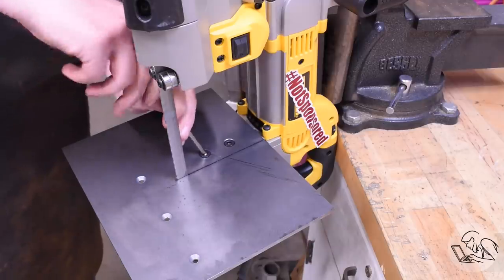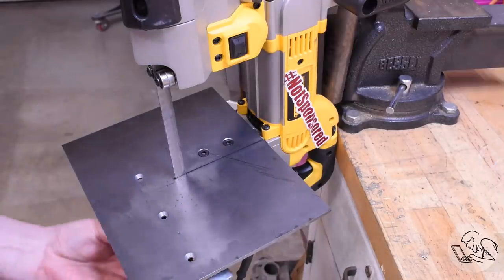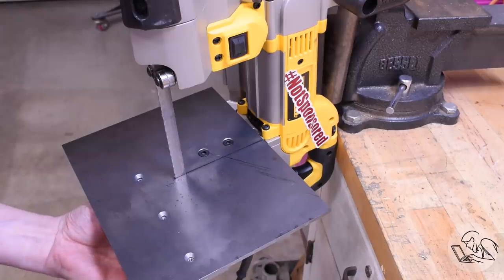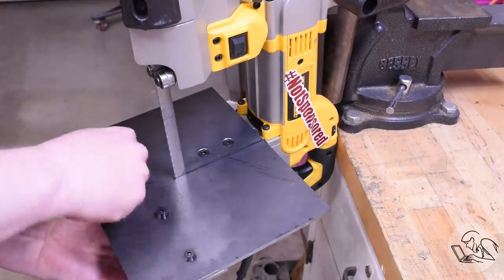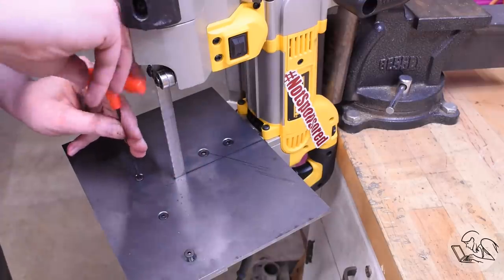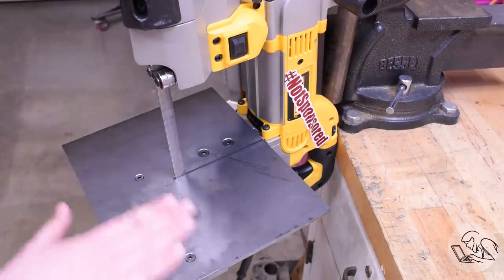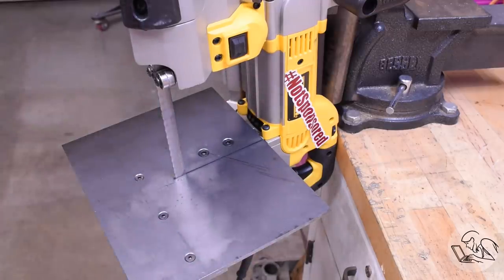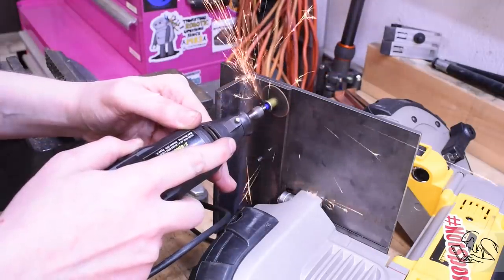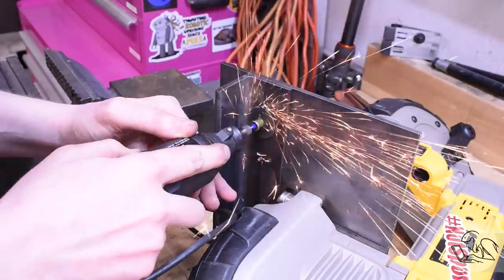I flipped the part 90 degrees, very carefully touched off on my machined edge, zeroed the DRO there, then moved out, touched off on the rough cut side, and just milled down to zero on the DRO in multiple passes — I end up with a nice clean edge that matches all the way down. Okay, let's do some final fit-up. I've got the table bolted onto the saw and now I can bolt the angle iron down underneath. The holes all line up because of the magic of the DRO. All the bolts are countersunk so nothing will interfere with sliding stock over the table. I had to shorten the bolts on the underside because they stuck down too far — a cut-off disc on a rotary tool made quick work of those.